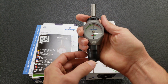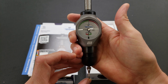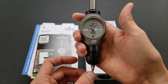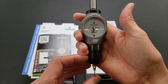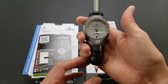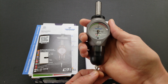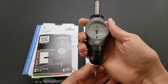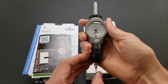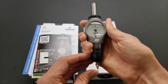This one's a lot smaller than the large one — it's quite slim. Pushing it in Z, it looks pretty smooth, but actually a little bit sticky. It's sticking when I push it up in Z; there's definitely a sticky spot there — does not feel good. It's past the zero point. The X and Y side-to-side is sticky even more so than the other one; it takes a lot of force to push it to the side.